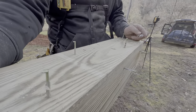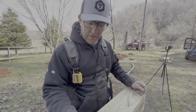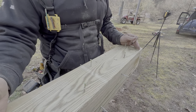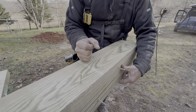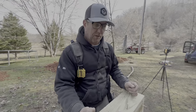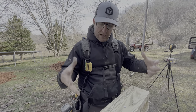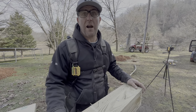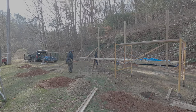Here's a little trick my daddy Arlo taught me. I'm putting some galvanized nails into the part of the post that's going to be inside the hole. When the concrete forms around it, it forms around these galvanized nails, and that helps it from ever coming loose inside the concrete or being pulled up out of it — it just holds the post down in the concrete a little better. At least that's what Arlo says. Could be full of crap, but we figure two seconds banging some nails in — if Arlo says it works, it works.